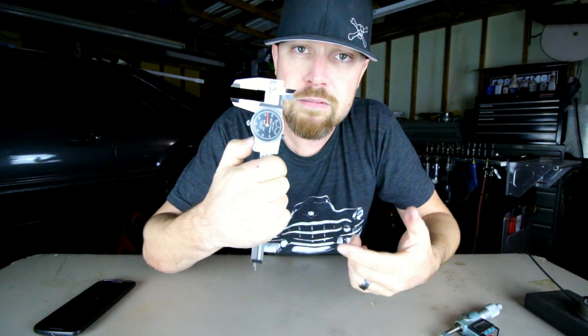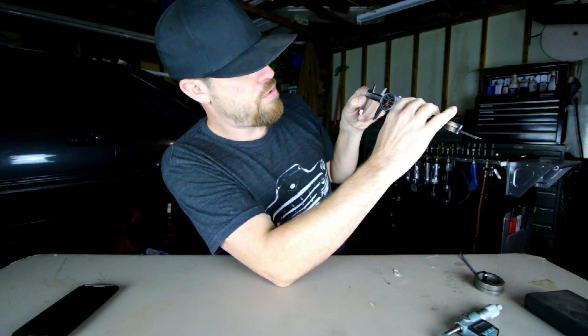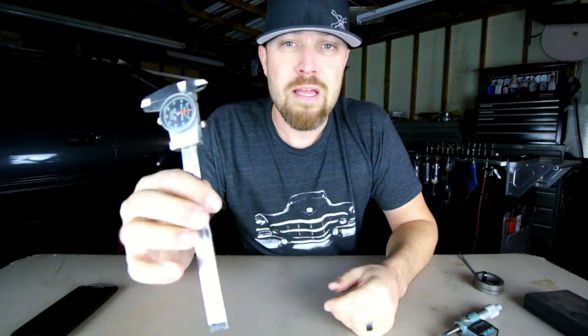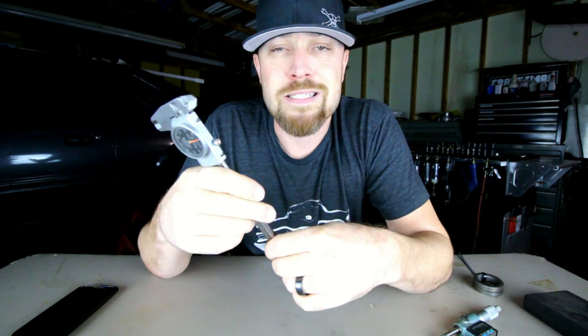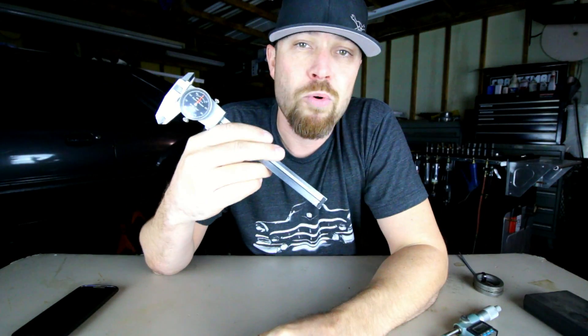What if you're doing sheet metal work and you need to measure the thickness of the sheet metal? You don't have a gauge meter — you don't need one. It's .063, it's .050 — you can measure it right here. The other thing that's nice about these is it's like one of those one-time tools. You buy one, it pretty much lasts you for the rest of your life unless you do something stupid with it. Most of the time they're in the case, very seldomly used — it's not something you have to buy on a regular basis. You probably won't wear one out.